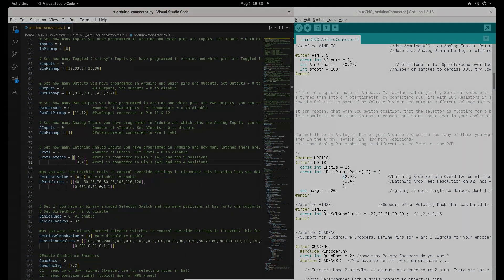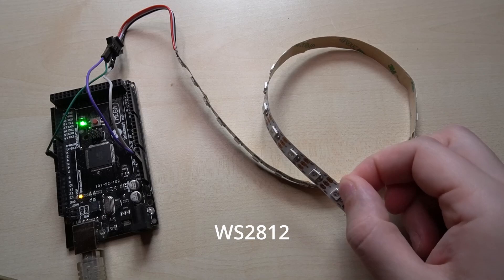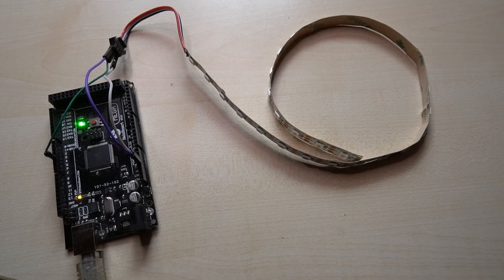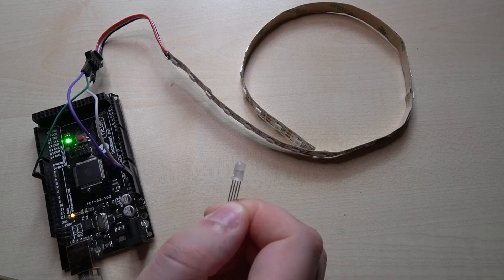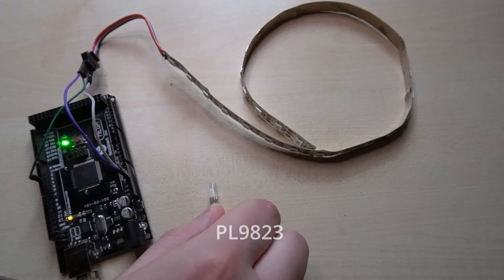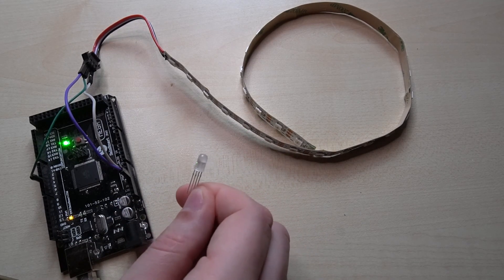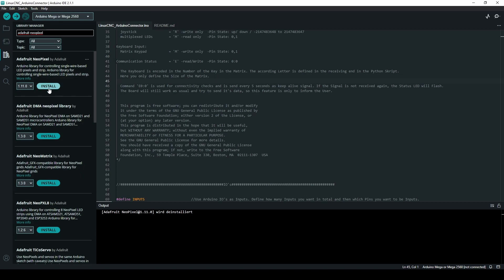Hi and welcome back. I'm Alex and this is the Art of Tinkering. I have now connected digital LEDs. These are called WS2812. They are connected by 3 wires — two of them are for power and one is for the digital input, connected to pin 4. In my build I use PL9823 LEDs, which are also digital ones. They work basically the same but there are a lot more wires to solder up. For this to work you have to install the Adafruit NeoPixel library with the Arduino Library Manager.